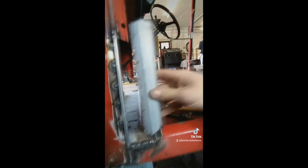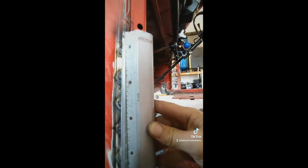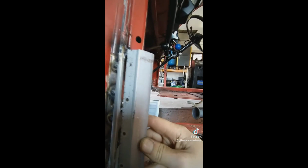That's the gutter rail welded in, and now I've got this piece. It wasn't angled, but the bottom of the sill is, or the top of the sill should I say, and I've marked it and cut it so it goes in near enough flat so I can get a nice weld on it, get it nice and strong. And now I just need to take the top off, because I always cut them a little bit tall so I can take them down a little bit at a time. Otherwise, if you cut too short, you're knackered.